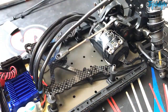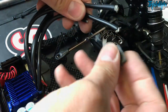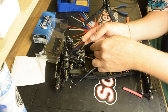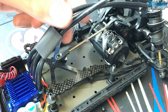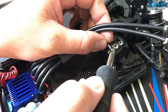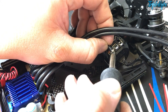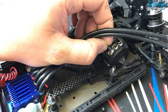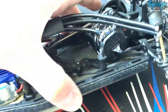Then I tin the area that I'm going to solder onto — I've just tinned the A terminal. But before that, put your heat shrink on. I almost made the mistake of soldering it on without putting the heat shrink on first. Now I can get on with soldering it. Put the soldering iron on the big part first — get the heat into the motor part — then lay the wire on and it will find itself. You don't have to put any pressure on. See how it looks; if there's not a lot of solder there you can add a little bit more afterwards — there's nothing wrong with that.